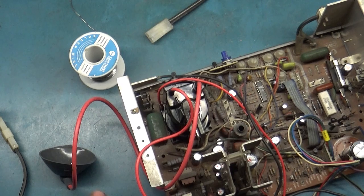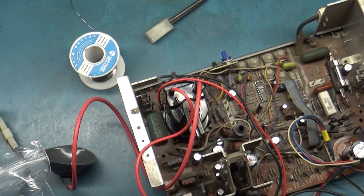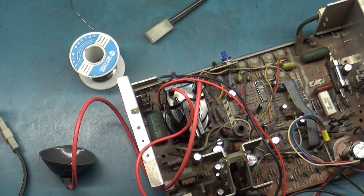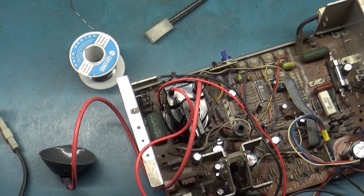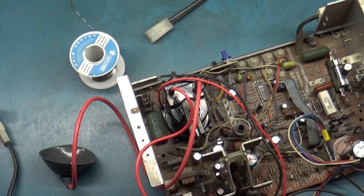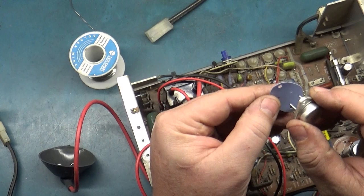So I had no reason to suspect the HOT was the cause because it read properly in circuit. And the notes that I was given said the voltage regulator was sparking, but it was not. It was the HOT that was sparking, and most likely because it was shorting to the frame. And I am confident that this will resolve the problem. If not, this will have to be put on hold until I can order some more voltage regulators, because I really don't want to rob this one from the working chassis.